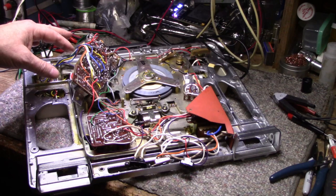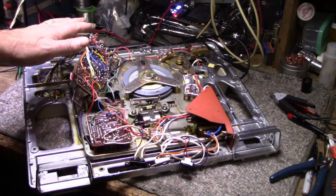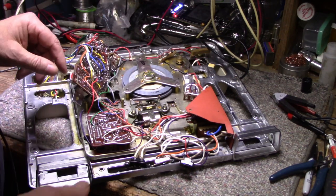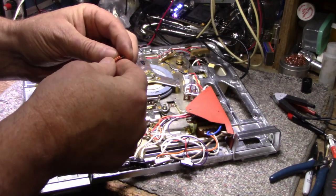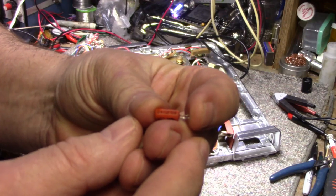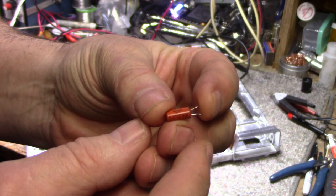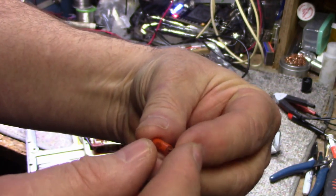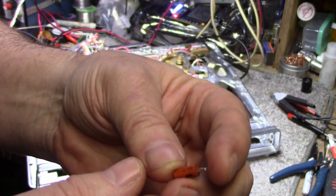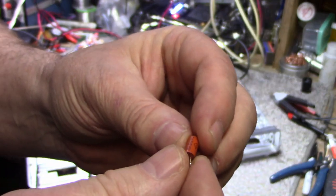And for your base zero potential, it's going to be your most positive, and then everything after that goes negative. So that's why they have the caps in backwards and the transistors are PNP. Here's an example. It's a 470 nanofarad electrolytic capacitor. It's NTK brand, like a Japanese branded capacitor from the early 70s or maybe even earlier.